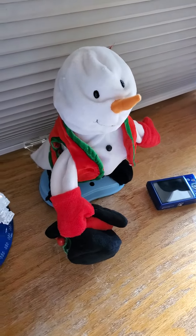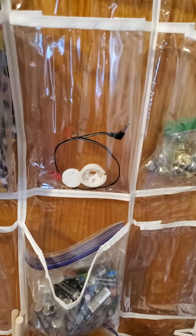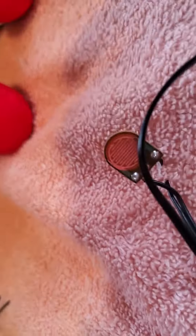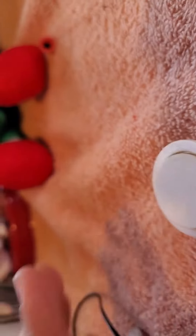What it's actually about: I got one of these, and the try-me button for my snowman broke. The wire just attached from here, and I think I know why — when this was shut, it was snapping. The wire was stuck here the whole time, and that caused it to eventually rip. It needs a dab of solder.